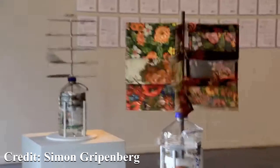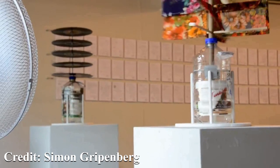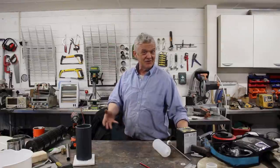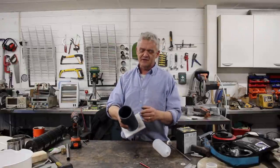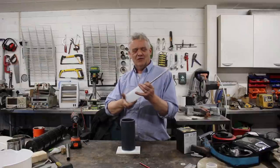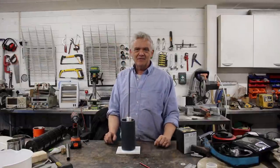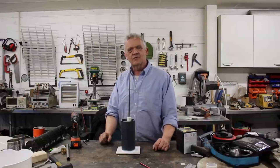If we look at the rotating discs from below, you'll see the bearing that Simon used. You can make a fluid thrust bearing from simple materials you can find around the house. What I've got here is a piece of pipe glued onto a piece of plastic — basically a cup — and in that cup I can fit an empty plastic bottle. On that bottle I've put a rod, an eight millimeter diameter rod. When we drop that in, we have the basics of a fluid hydrostatic thrust bearing.